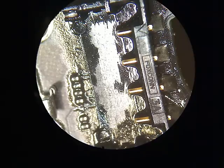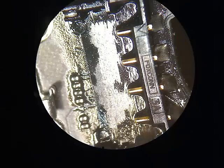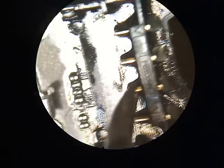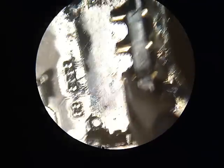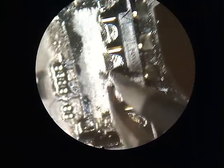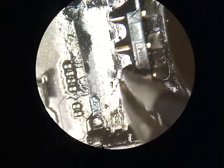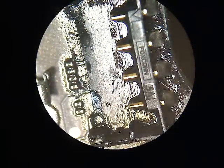The important thing about this method is that it ensures there are two retaining solder connections in the back, which is very important. Without those two being soldered onto the board, the connector will get ripped right off because it's not evenly soldered on. So if you only had a soldering iron and didn't have a hot air gun and this 138 degrees Celsius solder paste from CyberDocLC.com, you're going to have a hard time keeping this connector on the board from putting the connector on and taking it off — you'll break it.